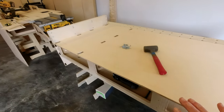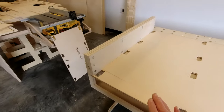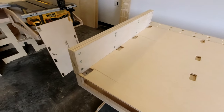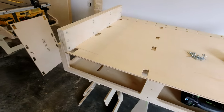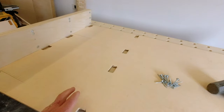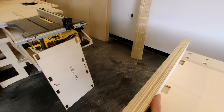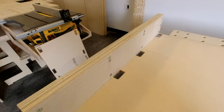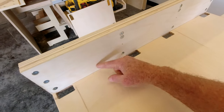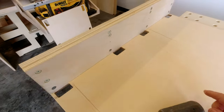This is a good example. I'm taking apart something right now that I glued up yesterday. This is all wrong — I've got the wrong material. It's too short by about a half an inch, and these are too tall. But in prototyping, this was very valuable because it answered my questions. The only connection it has right now is a single glue line, 18 millimeters wide, along this edge onto this half-inch plywood.